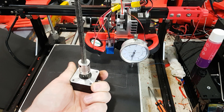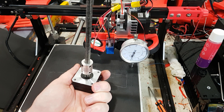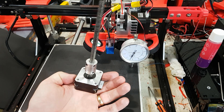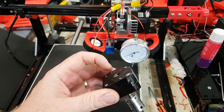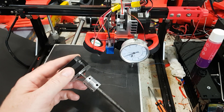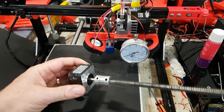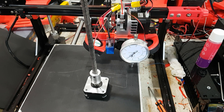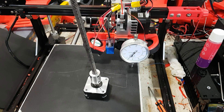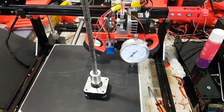That has made the motion really smooth and means the weight of the printer is no longer compressing the spring — just amazing. One last thing: when looking to remove springiness from your Z-axis, check whether pushing the shaft hard makes it move backwards and forwards in the motor, because a lot of them will. You need to remove the spring steel and put shims on the bottom to prevent that. So that's the ball bearing mod — you should all definitely do it. It's made the world of difference, enables smooth movement. See you later, bye!